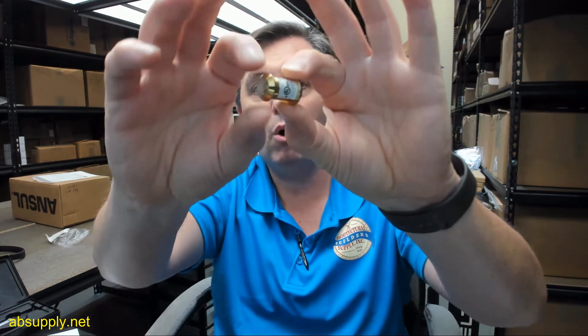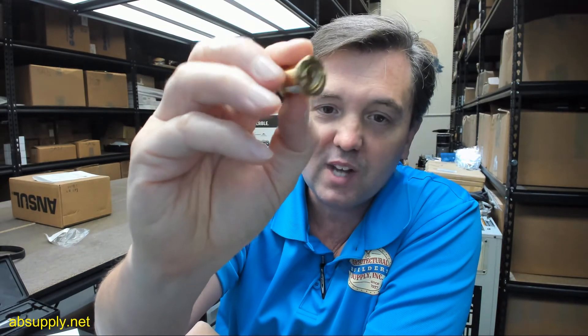You don't want to drill it too large, and you certainly don't want to just run the drill bit through your panel and explode out the veneer on the opposite side. What I do when drilling these — I have lots of experience — I will use an eighth-of-an-inch drill bit first to be sure I'm drilling straight through the door. It's preferable to do the door laying flat because it's easier to ensure you're drilling it straight. Then I take my bit and go through each side meeting in the middle so I'm cutting the wood cleanly and not tearing it out. Nothing will ruin a Saturday afternoon like ruining your door viewer installation, which should be a five-minute project.